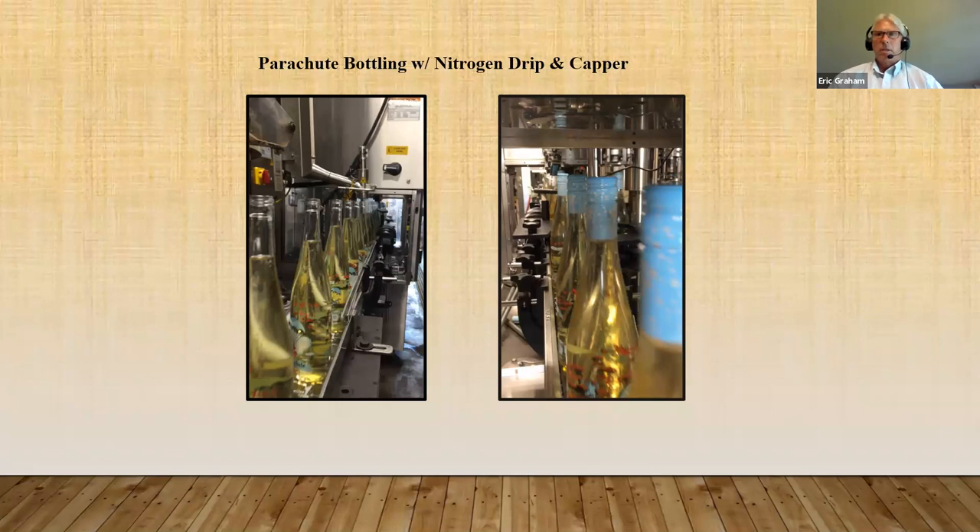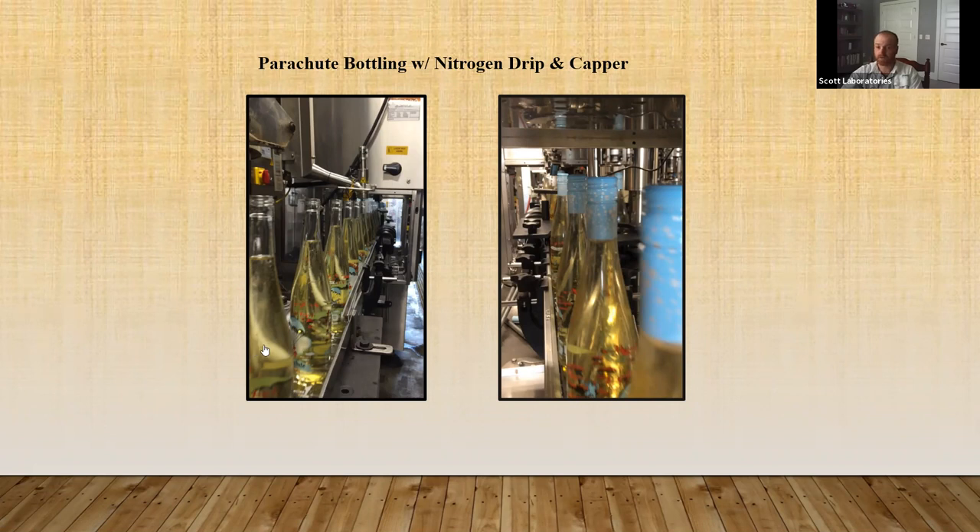We do make a 30 by 60 screw cap for a wine bottle that is meant for higher pressures than normal still wine. We have liner options for specific circumstances — semi-effervescent wines or even semi-sparkling wines — all the way up to about 6,000 parts per million or six bar of pressure as the max. Post was actually, as far as I know, the first winery in the United States to put sparkling-level wine — like six bar — under screw cap.